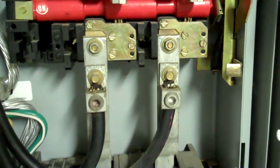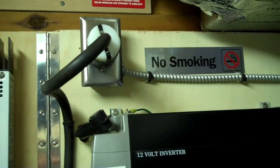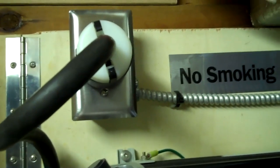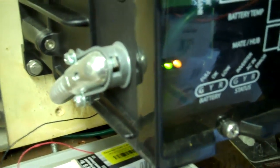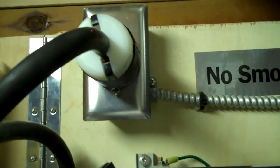We'll go into how I think most people would want to wire up one of their inverters. You can use the flexware system, which is all wired up for you — that's what's in the diagrams that come with these things. The way I would do it: I'd have my 30 amp plug that feeds the inverter, which also is where the grid tie feeds back through — it actually pushes against the circuit that it's plugged into. On the output of the inverter, that MC cable, I'd run that out and set another twist lock box exactly like that one.